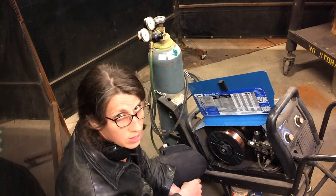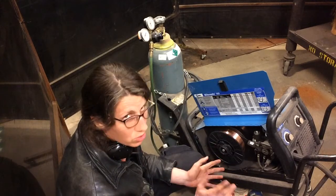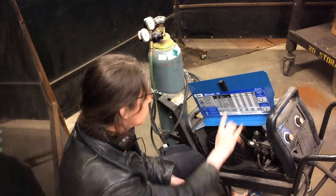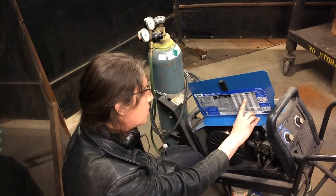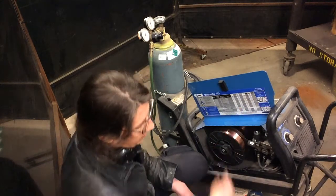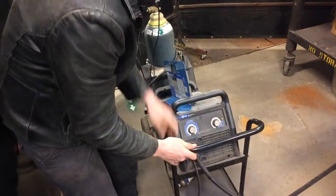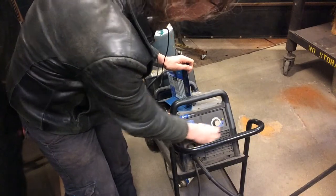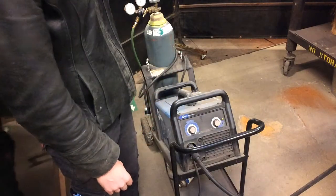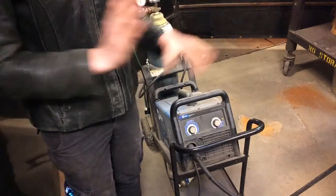For our test demonstration, we're going to be working with 16 gauge steel. It's thin — not so thin that you burn through it, but not so thick that it's really hard to weld — and it allows you to do a lot of sheet metal forming, making boxes, and general shaping. Going over to the 16 gauge column, it says set your voltage to 5.5 and your wire speed to 55. At this point we're ready to weld. All we need is a table and an outlet, so we're going to change our field of view and show you how to set that up.